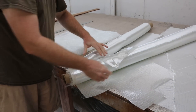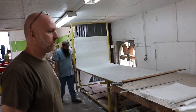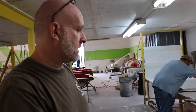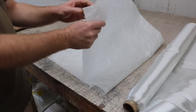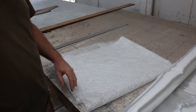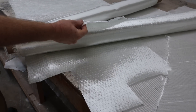So how many different types of fabrics do you use, and where do you use them? There are about six different types of fabric that we use, and we use them in different places that require different structural characteristics. Most people think of fiberglass as a mat, like this, and this for us is just filler material — compared to any of these engineered woven materials that we're using for different parts of the machine.